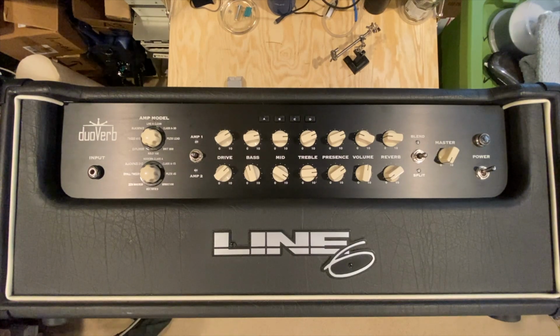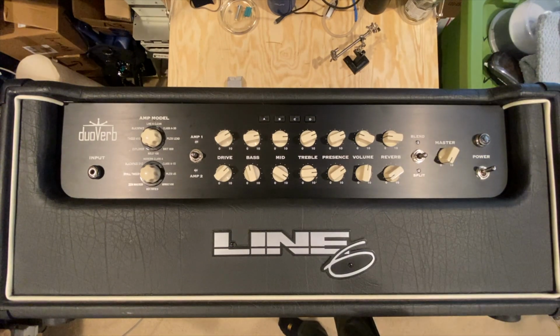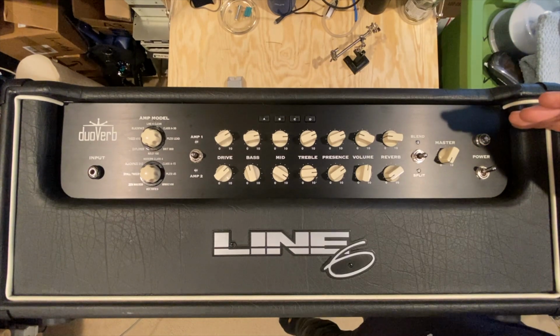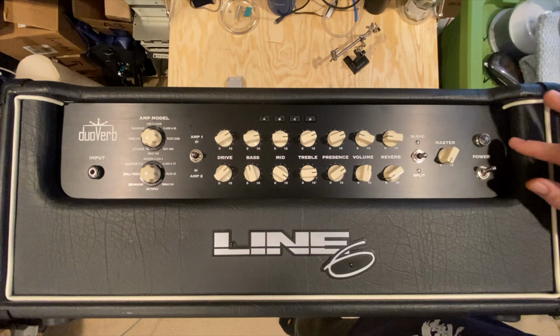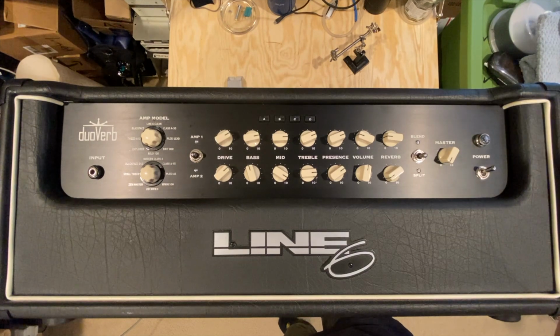120 volts. Let's see what we can get. Right here. 120 volts. Still have a flickering inside, so that tells me there's definitely something going on in the power section. I also started seeing some flickering on the bulb on my current limited power supply. So my guess is obviously this is more than just an intermittent problem. Definitely something in the power section if we're seeing something trying to turn on and then not being able to do so.